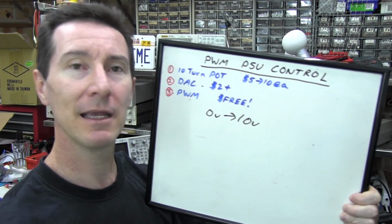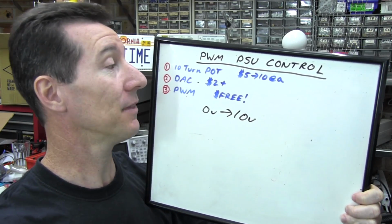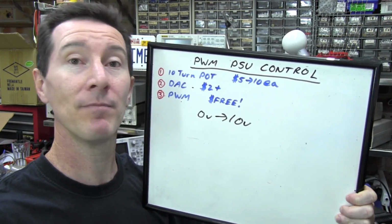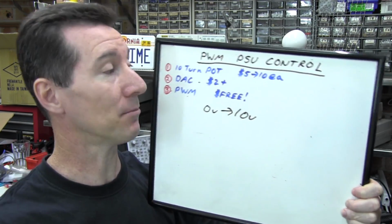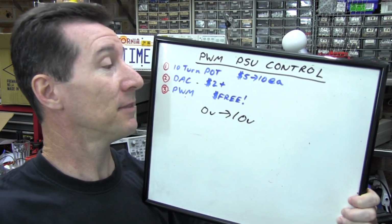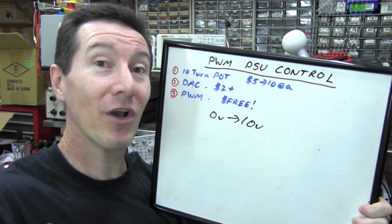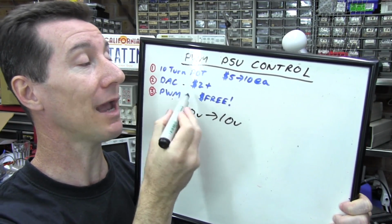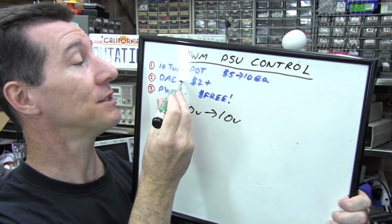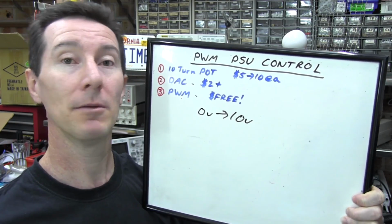Now, in terms of the DAC, you know about digital to analog converters, or if you don't, look them up. I won't go into them here, but basically they're a dedicated device. You feed a digital signal in via, usually, a serial input these days, an SPI or an I2C interface, or if they're built into the micro, they could do that, and they give you a direct voltage out. You don't have to do anything else with it. They're magic. But a pulse width modulator is exactly the same as a DAC. It works differently, but it gives you the same result. It gives you a voltage output, just like a DAC. And the resolutions are exactly the same as well, because if you're working with a 10 or 12-bit DAC, it's going to give you exactly the same voltage resolution as a 10 to 12-bit PWM.